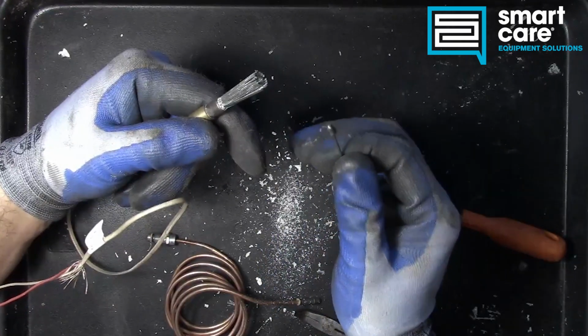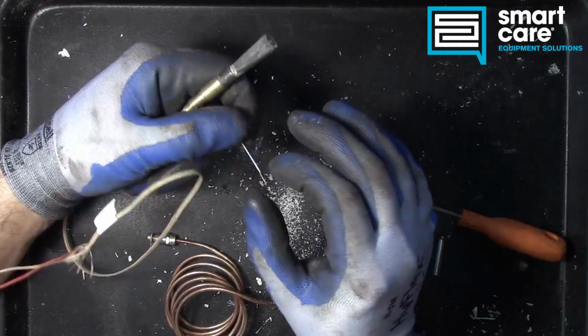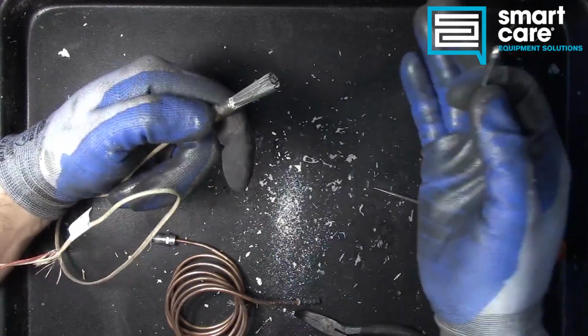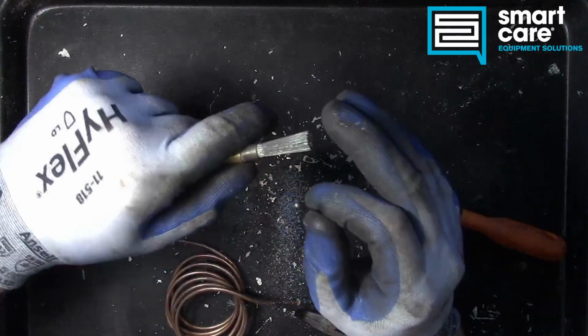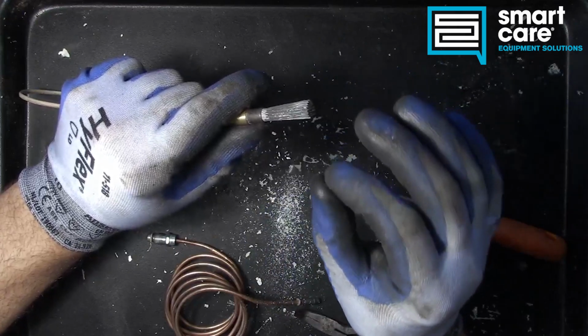When we talk about how they fail, the most common failures are either low output or no output. So you can have a low or weak voltage output from a thermocouple or a Thermopile after they've had months or years of exposure to that high flame temperature. You can also have no output. You can burn up a thermocouple or a Thermopile.